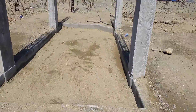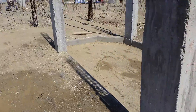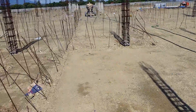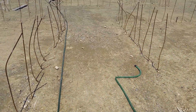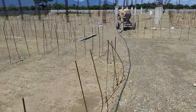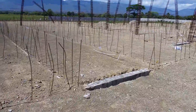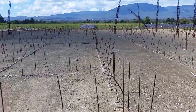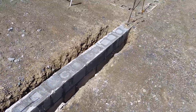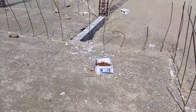These columns were poured up two meters high. They were done because they were freestanding at the time, so we could get this compaction done in this area. During the compaction we used a hose very regularly to water the fill material so that it would properly compact. Basically the only thing left to do are these little areas where we added some block work after we had done the fill and compaction.